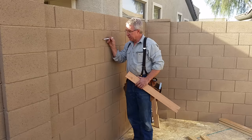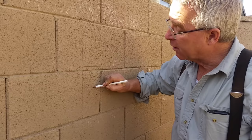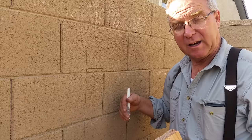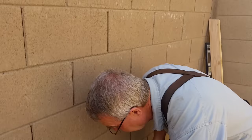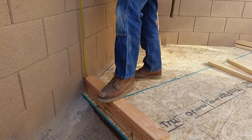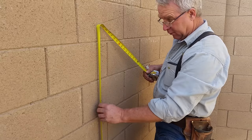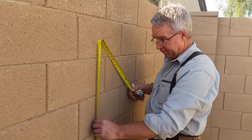This line designates the top of the rafter. That line designates the top of the wall system — the top of the crown plate. There will be a crown plate, top plate, bottom plate, and stud. I'm calculating my stud length right now. I can either measure all the way from the floor to this mark and subtract 4.5 inches, or I can put three 2x4s on the floor representing the bottom plate, top plate, and crown plate, then put my tape on top of that stack and measure the full distance. We're 4 feet 5 and three-quarters inches. That saves doing the math — the boards subtract the distance for me. Do that every chance you get.